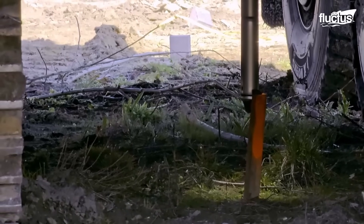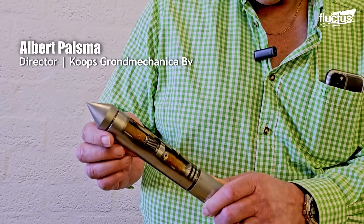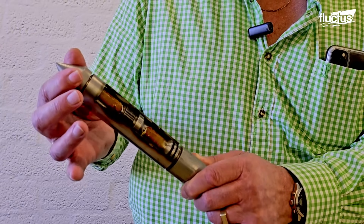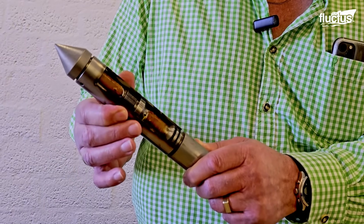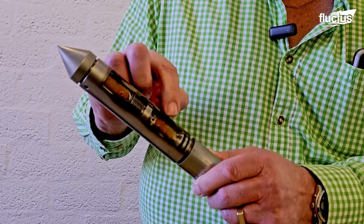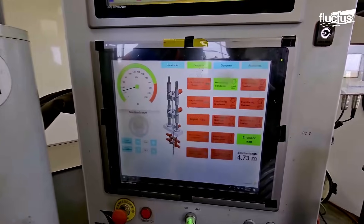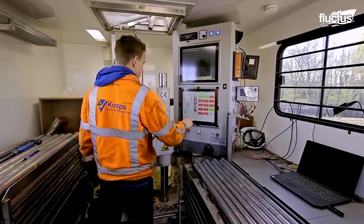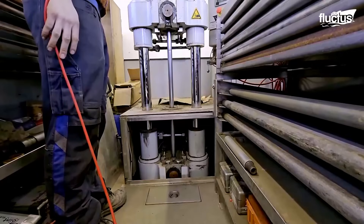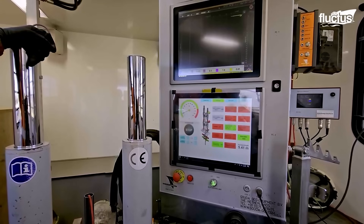This is a typical cone — an electric cone, it's an old one, but we have opened it to show it to everybody. With this cone we can measure the tip, that's this part, and we can measure the friction. Inside the cone, strain gauges are used to measure the force needed to push it into the ground. Perhaps the most impressive thing about the cone penetration truck is that it's fully fitted with computers to provide real-time data.